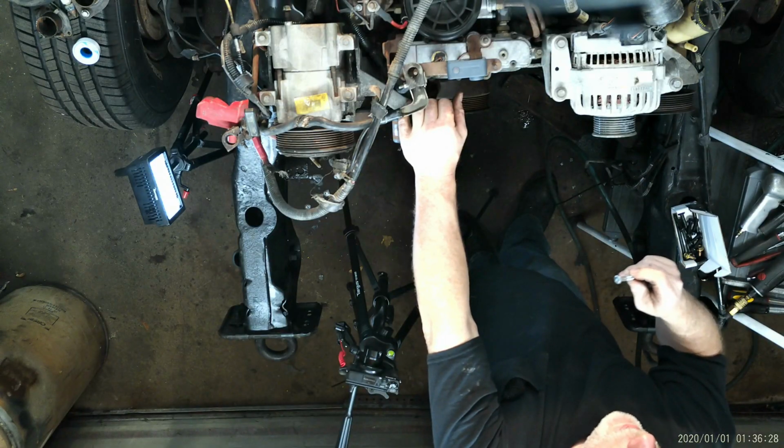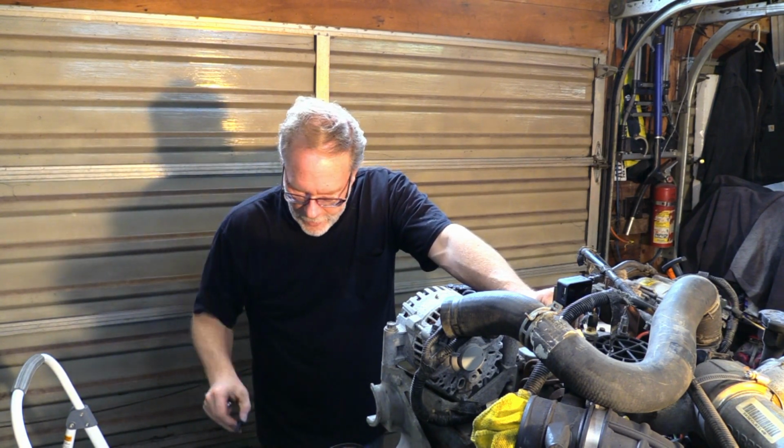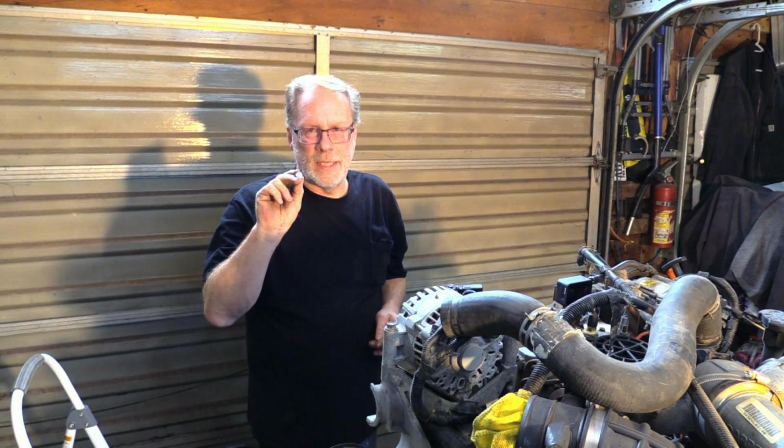If you get chrome bolts, you don't use these. Throw these away. Put them in with the rest of your bolt collection. Do not use chrome bolts. These do not have the stretch like these metal ones or like these black ones do. These are a different type of rod when these are made and pressed. You have to get the black ones. These are the ones that heat and cool and heat and cool and still hold their same amount of pressure onto the timing cover. So once again, chrome, get them out of there. Also, Japan, China, Malaysia, India, they have a really cheap black bolt, but you'll see it because on the end, it won't be marked with the metric sizing. So then you'll know you have a really cheap one, and those definitely don't use, throw them in the garbage.